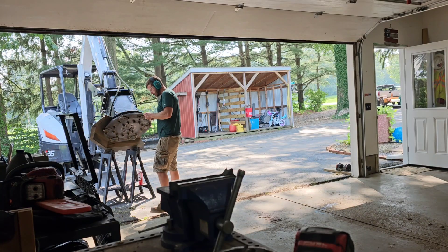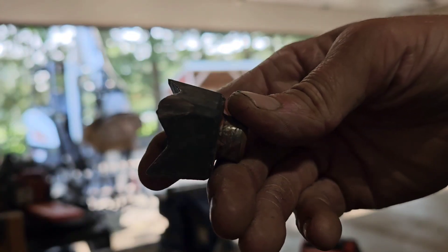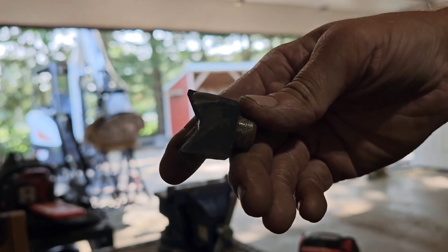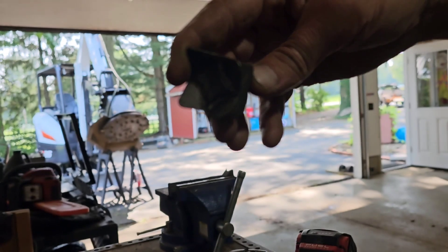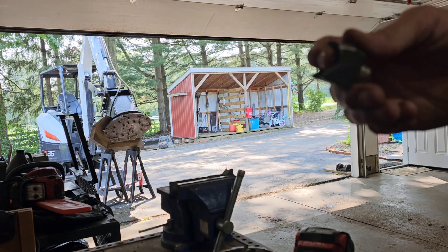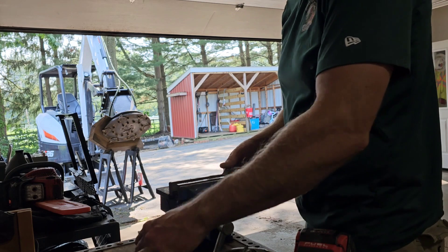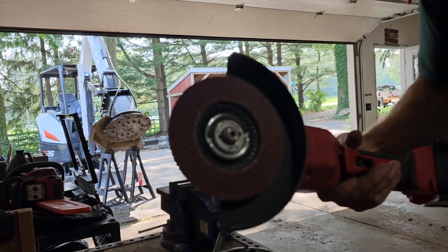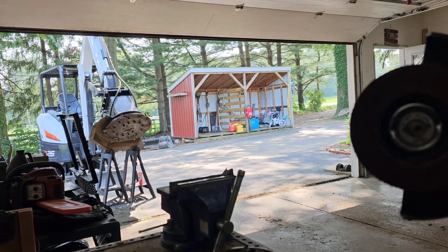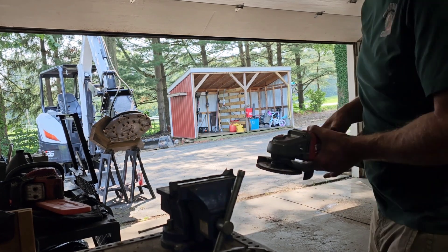That's the outside tooth — it's getting worn down. You've got to sharpen this inside edge of them. I've got a forestry mulching job tomorrow. I hit some concrete on the last job, so this will be the first time I've ever really sharpened these. I just have a 120 grit flap wheel disc. The videos I watched said you just kind of reshape it and you want it flat, so we'll try it.